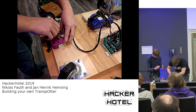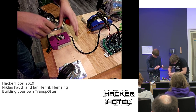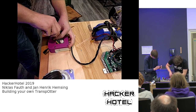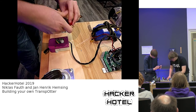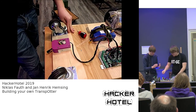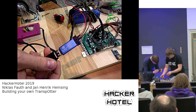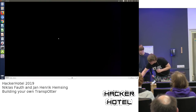Next thing would then be to flash the firmware, because if you got the main board from an original hoverboard, it has some completely different firmware. And to change that, you need a programmer we mentioned earlier. So now this is connected also electrically. And now is the time to bring life to your transporter. For that, you need one of those ST-links. And I think now it's a good point to go back to the slides again. And I hope we don't need the camera again.